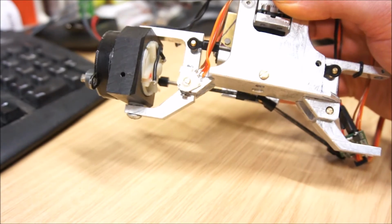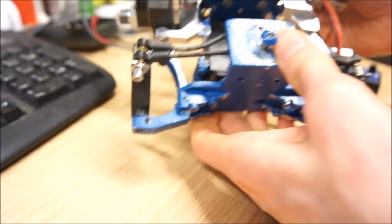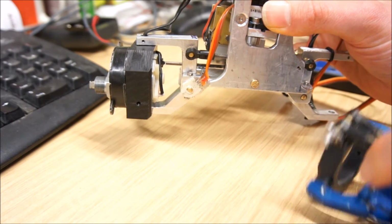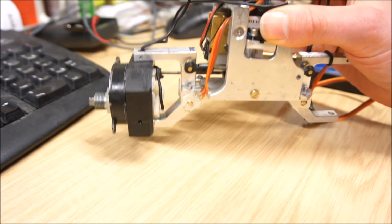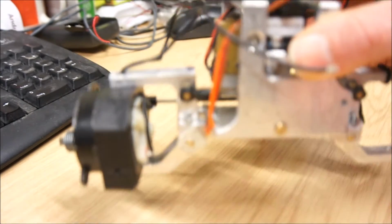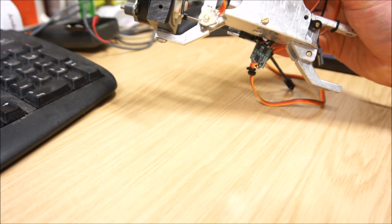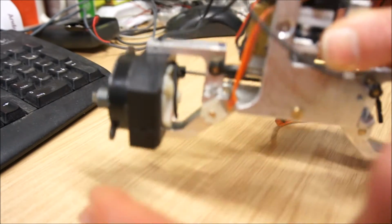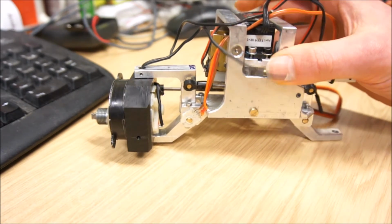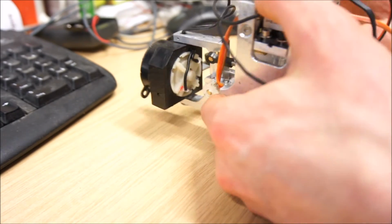If you compare where the motors are here and where the motors sit here, I do have more ground clearance than before. That's another thing that is important for graders, because you have to drive over the windrow of material that you have deposited in the previous pass. You have to go over that and not interfere with it, so that the mold board can move it further to the side for your next pass. Obviously, depending on what specific work you're doing with your grader.